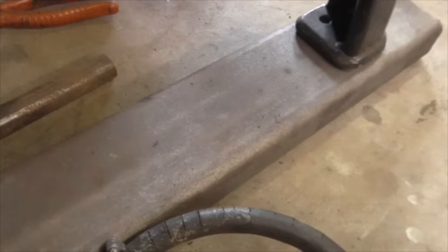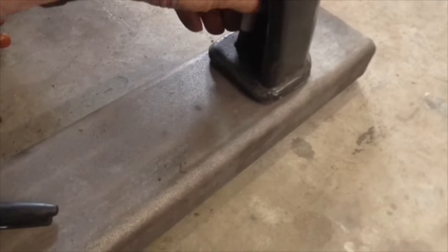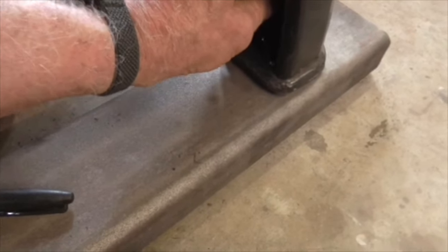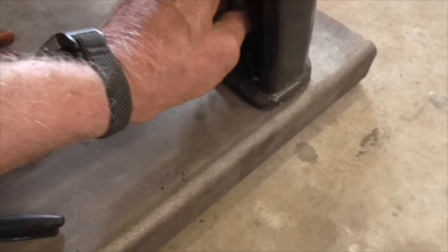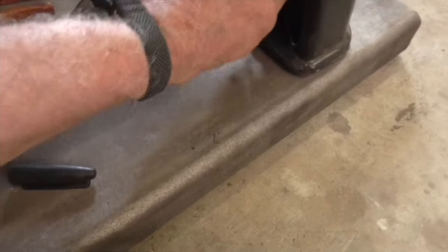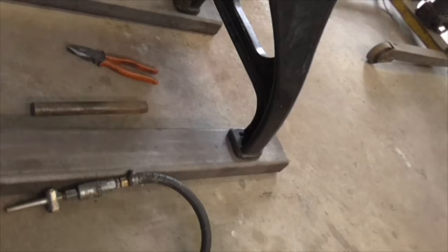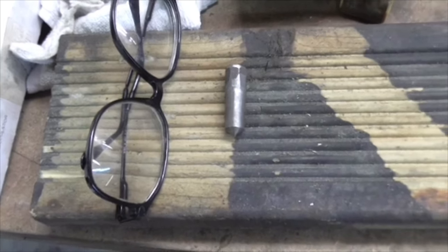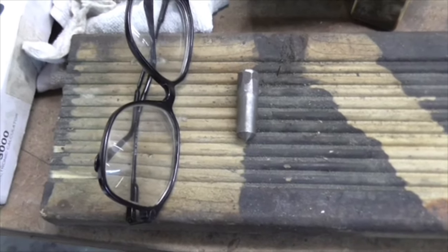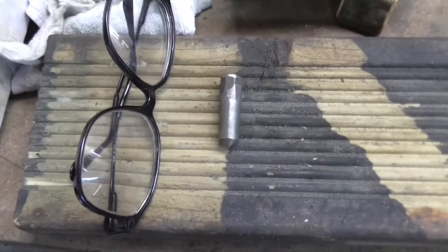I don't know if I can reach through there with a felt pen even. I might be able to. Yes, I can to an extent, and I'll get a centre because it's actually going and marking better. I might be able to mark a bit more by doing that, but I want a definite punch mark to drill to. Right, onward. And there it is, folks, the very short centre punch. I shall pop down the holes, give a sharp tap, and hope and pray that it marks it.